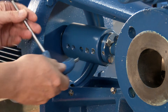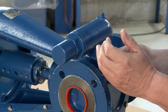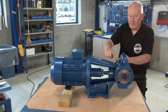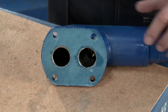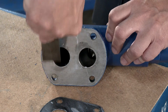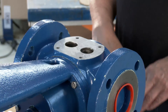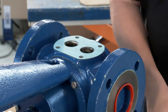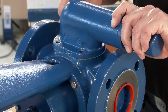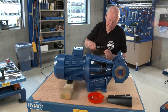Now replace the gasket on the bypass valve. To renew the gasket, remove the bypass valve from the pump housing and loosen the set screws. Be sure the valve is pointing in the direction of the suction end. Remove the old gasket. Clean the surfaces properly. Fit the new gasket onto the pump housing and mount the bypass valve onto it. Tighten up the set screws. Mount the guards.